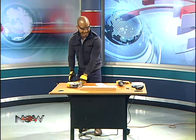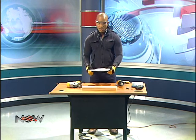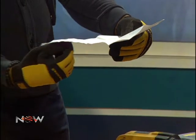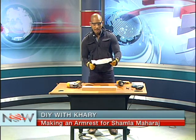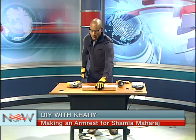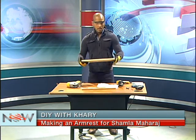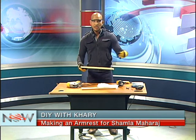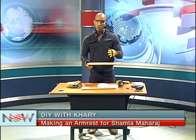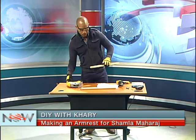You would also need a piece of paper and a pen. What you need to do is put the paper on the underside of the arm to find out where those holes are to fasten. I marked with a pen on both points and found where the holes would fall, so I could measure and translate that onto the piece itself. I have two one-by-four pieces here, cut to 18 inches, because that is the best length for the arm. This is actually wider than the armrest she has right now, because she wanted something a little wider and more comfortable — so this is a really custom piece.